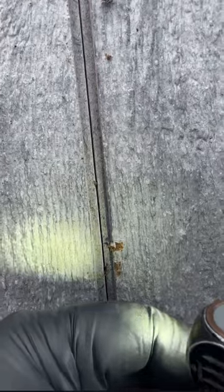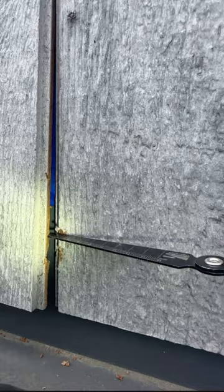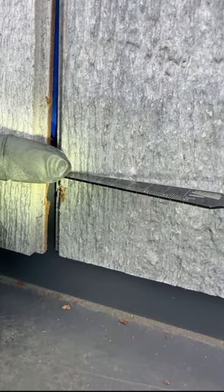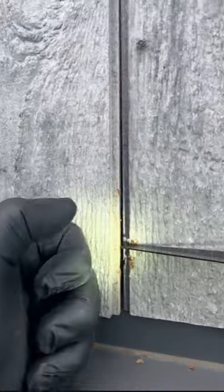Can you see this isolation foil? I managed to lift the panel up a bit, and you can see this isolation foil — that blue color right there. It goes behind the flashing, but it should be over the flashing. And they're getting water into the property because of this.